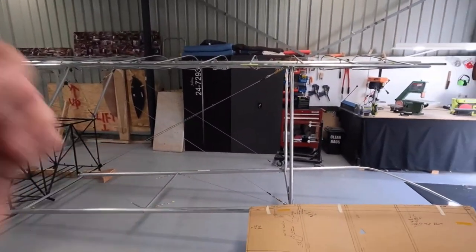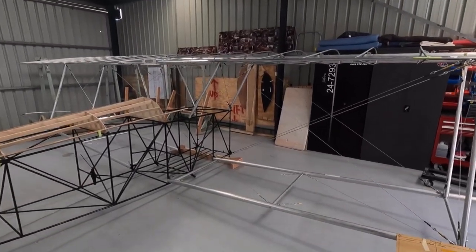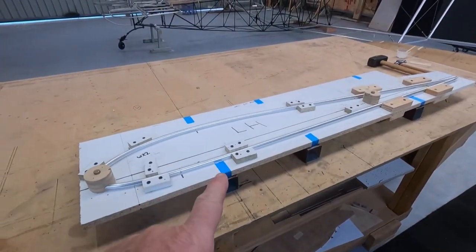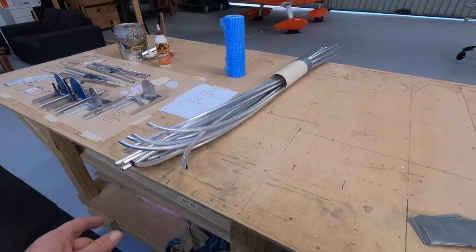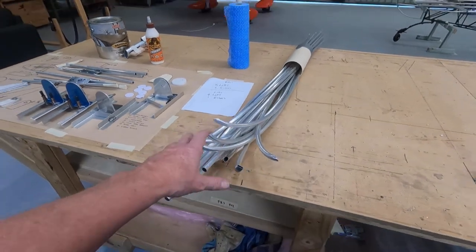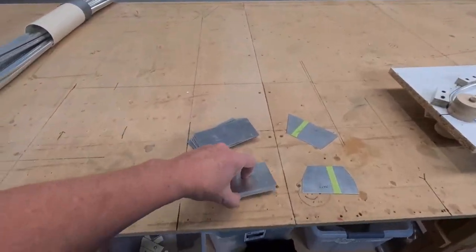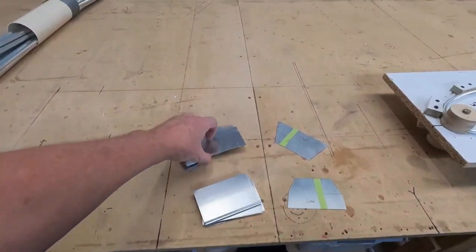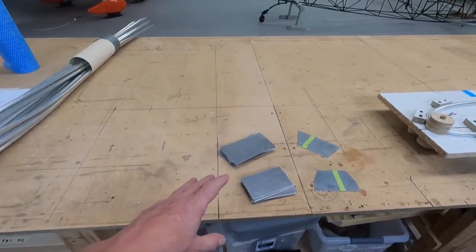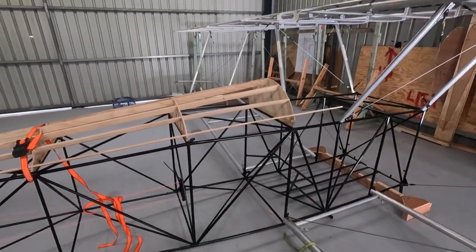I might start on some wing ribs on the bottom — they've got to be done, sort of haunting me a bit — so I'll start making up some brackets. Procrastinating is not going to get it done. Rib back in the jig. I've got some straight stock here so we're going to go back to day one and bend and cope some more ribs — that's enough for one bottom wing. I've got to fold up all these brackets — there's 20 there and 20 there. I've got to cut them out, polish them, buff them, fold them, rivet them to the ribs. Let's do it.